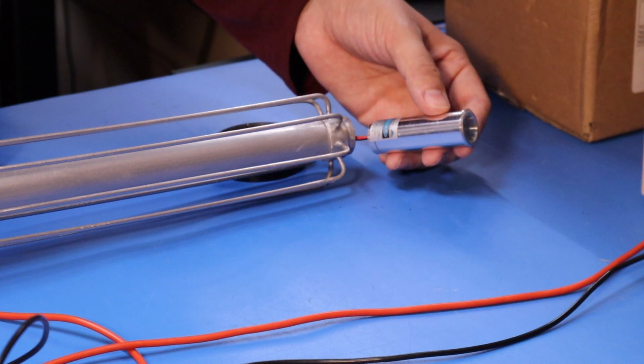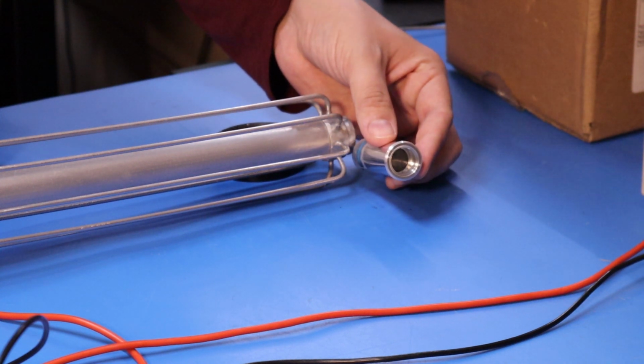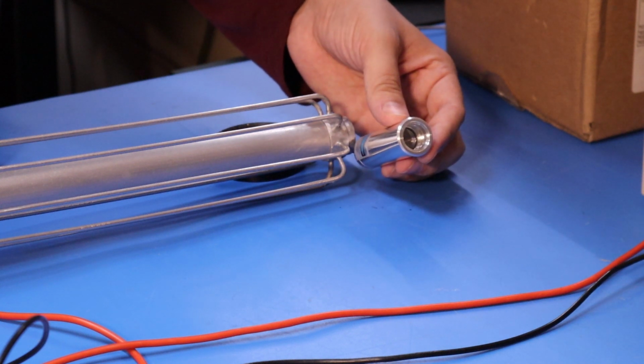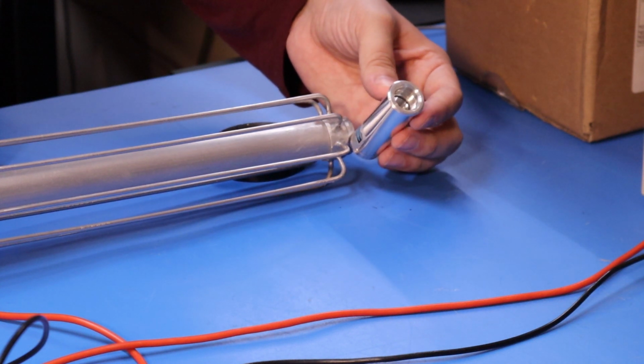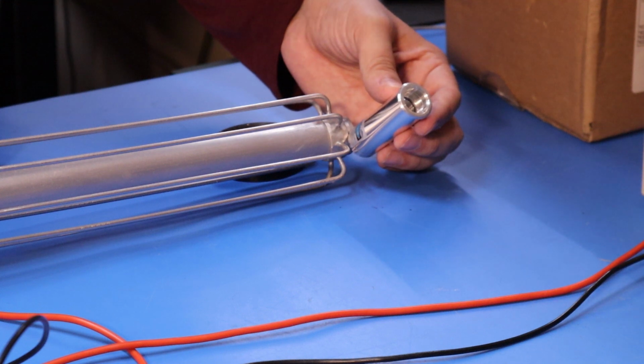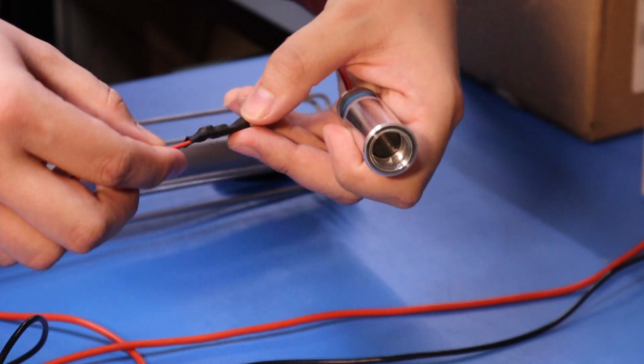I should be able to turn this on and off just by turning on and off the power to it. I don't have to worry about the current limit or anything like that. So I should be able to switch this on and off just by a simple MOSFET, hopefully. If I could time turning on and off the MOSFET power to the laser diode with playing the audio for the gun effect, hopefully that'll look alright. On the actual cable themselves, I think they put a DC-DC converter or something like that on there.